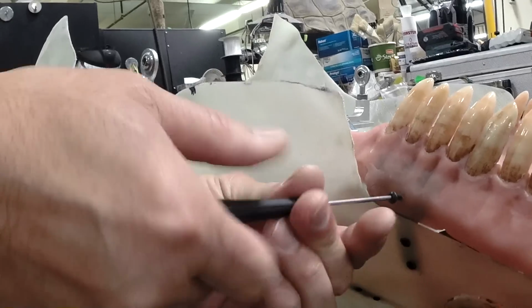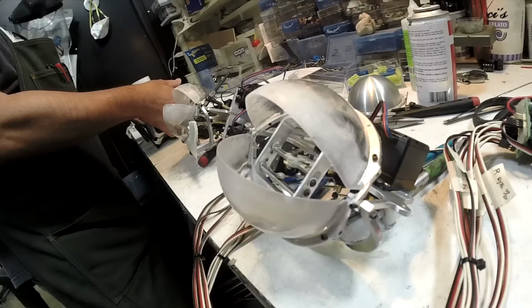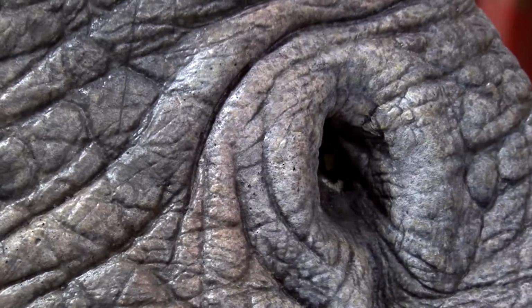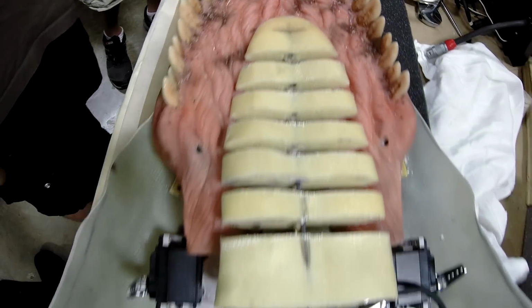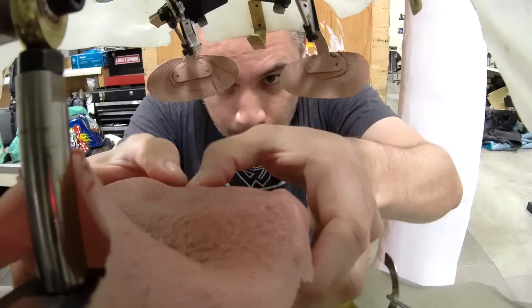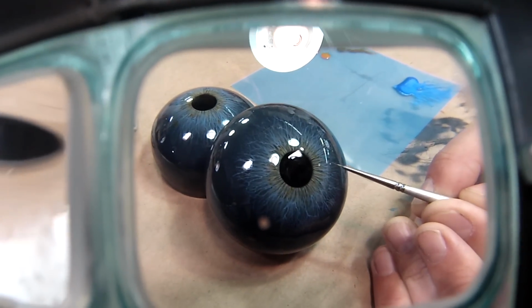And I've asked for this thing to do the world, all kinds of muscles moving. Just throwing everything that we have. You're getting blinks and eye movement. It can snort and actually blows air. We had a series of 3 bladders going through the throat to replicate kind of a swallowing mechanism. Subtle, but it's effective. Everything that you can possibly weave into this creature to give it that emotional feeling and make it act, to make it perform, to become a character, not just an animatronic thing. To really breathe life into it.